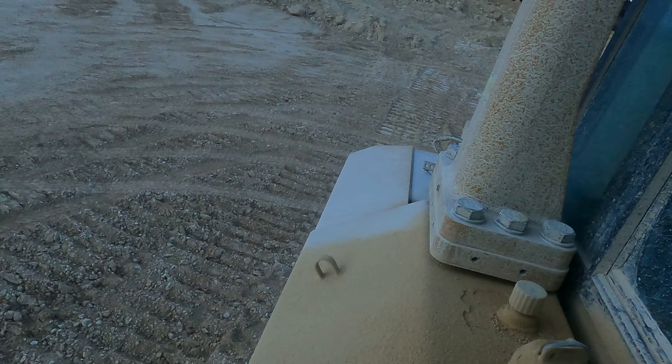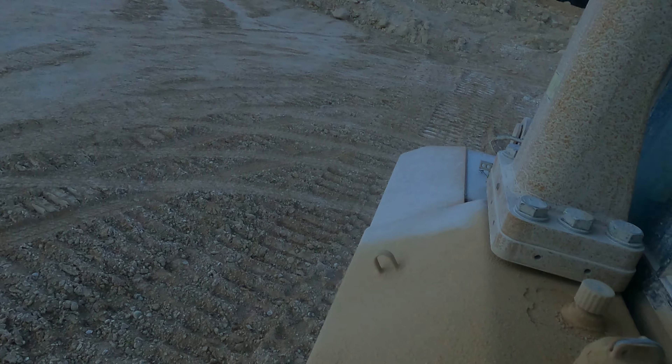That check — this would be the fill for that, by the way. This here is the fill for the hydraulic fluid, and that one's a tough one to see because you gotta walk out on the push arm. There's a little window right here and of course the liquid is clear. Basically what you gotta do is look right there — you see at the very top of the green, you can see where that fluid is. So hydraulic fluid is great. All right, ladies and gentlemen, it's time to go blow out the filters.